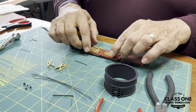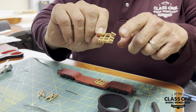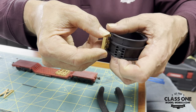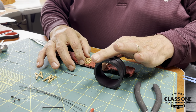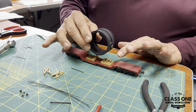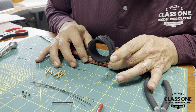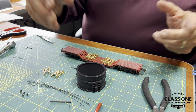There are two pieces of cribbing and they go one to either side. If you look at these closely, they are not even because there's a taper on the ladle piece. They kind of taper with that ladle and are going to rest along the edge. Two are close together and one is further out — the two are in the narrow part at the back and the other one is up towards the front. There are two of them and they're opposite hand, which makes it easy to tell which way each one goes. We want to locate these on the deck using our ladle section, making sure we're square and evenly spaced side to side. When I remove the ladle, there's a chance the cribbing pieces will move.